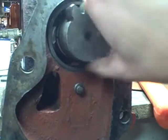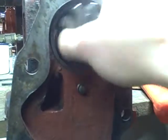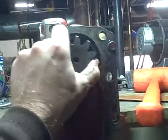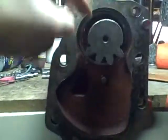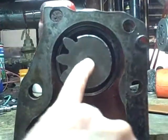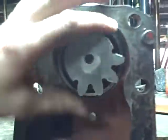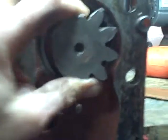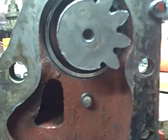Let me try the wire wheel on it - I don't want to get too aggressive. That didn't seem to make much difference. But what I'm noticing is it sure looks like the space between the inner surface and the outer race changes as I rotate this, which would explain my problem. The center hole looks like it's moving - it's not staying centered as I rotate it. There is a little bit of play in there, but that's not helping.